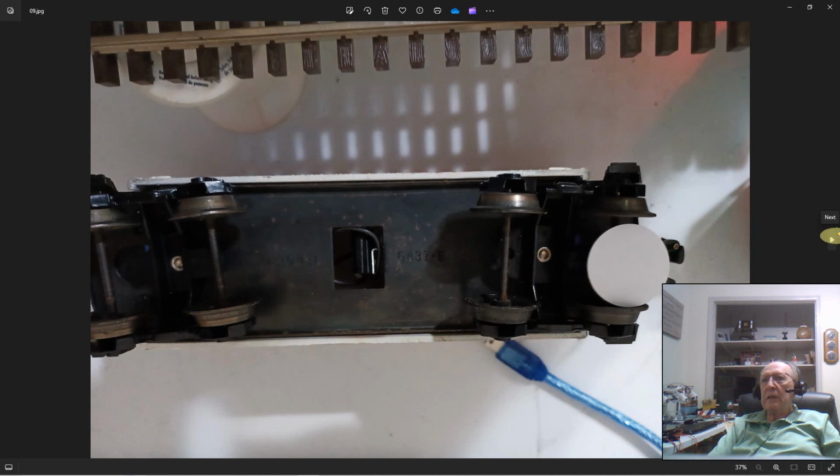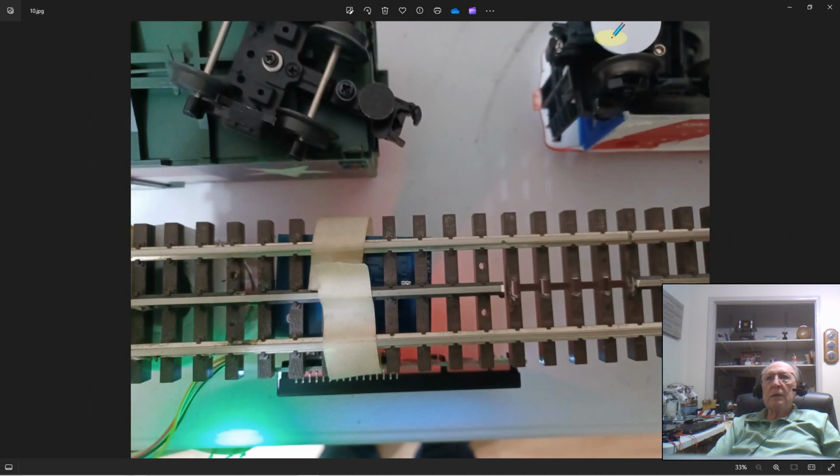So let's explore what I did here. Since I had been working with that metal car, I put it over that reader and it wouldn't read. And I thought, problem. Is it because of the metal of the rail here interfering with the reader? So I experimented, and you can see here I cut a chunk of the middle section of the rail out just to troubleshoot. I mounted this reader over here, and I ran that tag over, still wouldn't read. So then I moved the tag from the belly of the car to the coupler of the car and ran it back, read like a champ.